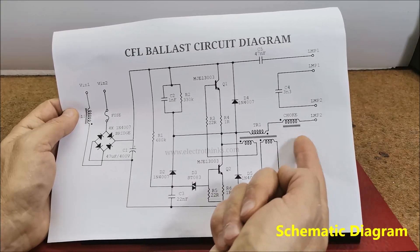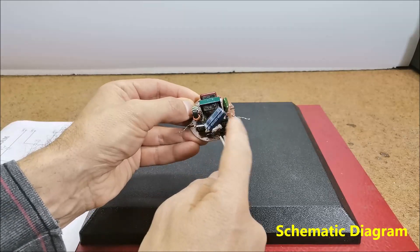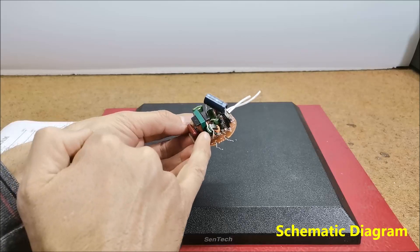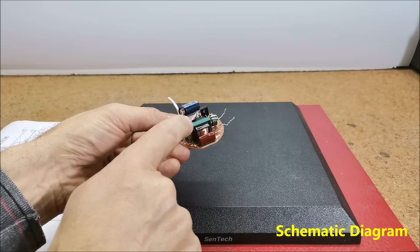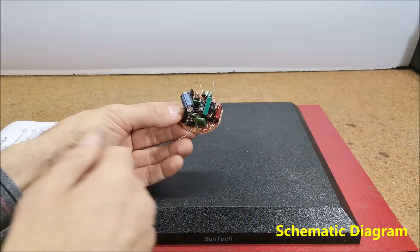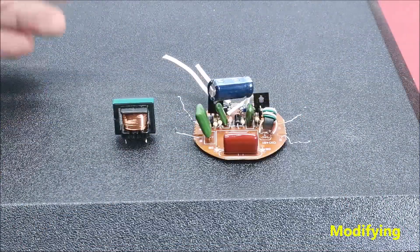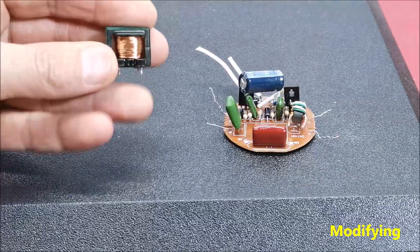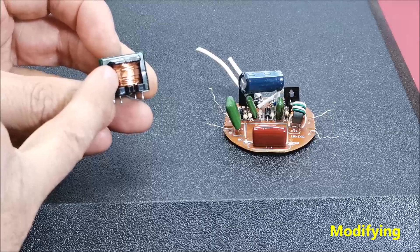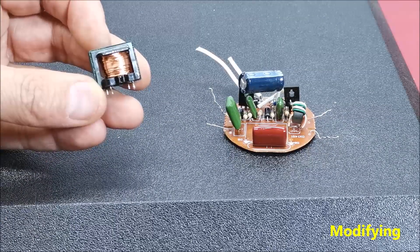And finally a glass tube filled with mercury or argon gas coated inside with a phosphor. In our case the most interesting part is this choke transformer. So these are 4 diodes with filter capacitor, switching transistors, toroidal transformer with 3 windings, and choke transformer in the form of a standard mini transformer. It is very important to emphasize that all CFL power supplies, regardless of brand or wattage, contain this type of choke transformer. When making any device, we can freely ignore the rest of the circuit and use the changing magnetic field created by this coil of the choke transformer. Our task is to wind about 10 windings with lacquered copper wire with a diameter of 0.8 to 1 mm, which actually represents the secondary windings.